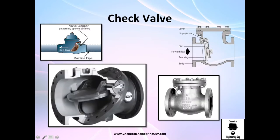The check valve is a very common valve used to avoid counter flow. If there is reverse flow, it pushes a little flap closed so there is no flow in the counter direction. It's impressive how something that simple can avoid something that would definitely destroy your pump. If forward flow pushes the flap, it opens and allows flow through. There's also a button to lock it permanently closed if needed.